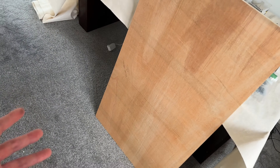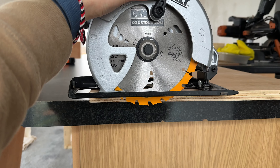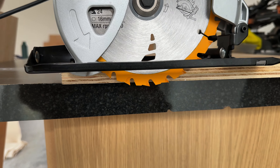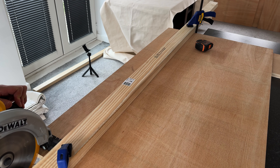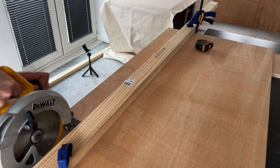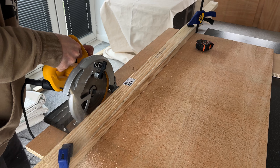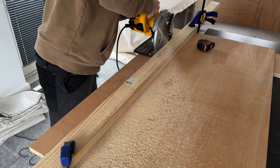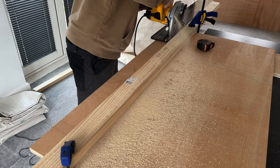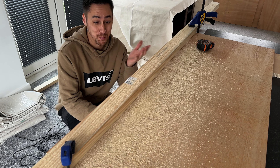I'm all ready to go. I'm going to put a piece of scrap plywood to give me enough clearance so I don't cut into the bar. I've set the saw up so I'm just about clearing the plywood. All it's left to do is measure up and make a marker, then clamp down some 2x3 to use as a guide. That was quite scary, but it worked really well.